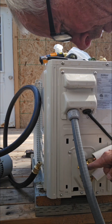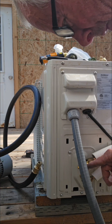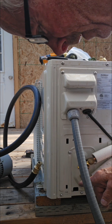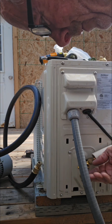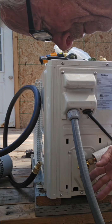In case these have a single O-ring or double O-rings on them, whether single or double, that's what holds all your refrigerant. And there are little O-rings, and then inside here it's a little valve core. You saw it before when I just showed it to you. That valve core has got a little plastic washer. Really, not even rubber, it's plastic, and it needs to be protected from everything.